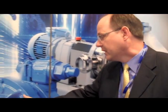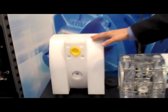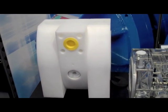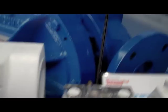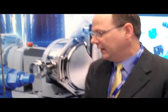Therefore, you would use a U-E, for example, made entirely of PTFE — very chemically inert, very resistant to chemical attack. So in this case, you have a pump that will not contaminate the product, and being PTFE USP Class 6, it can actually be used even for injectable products.